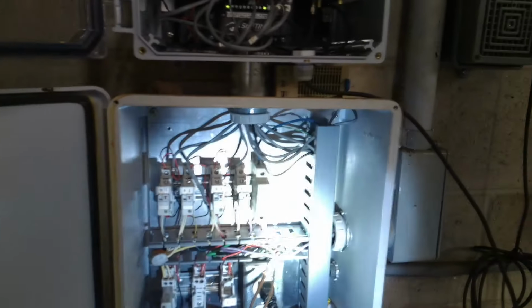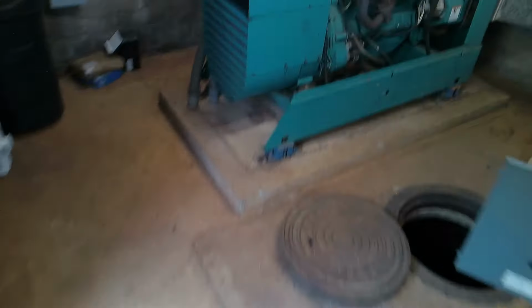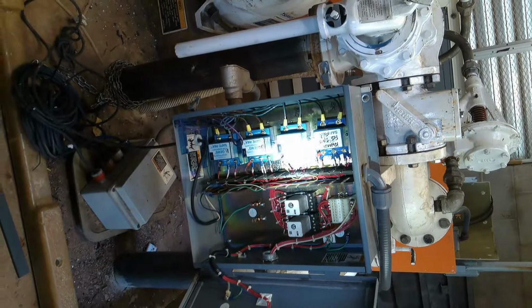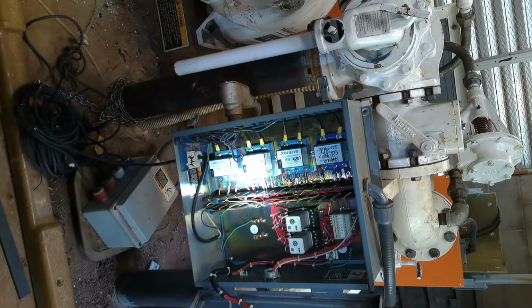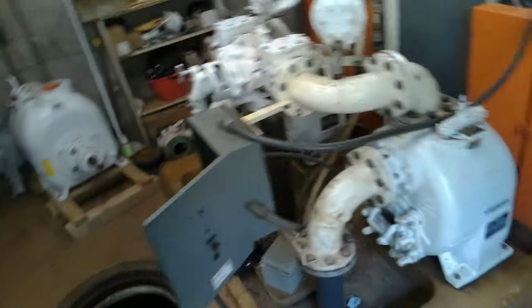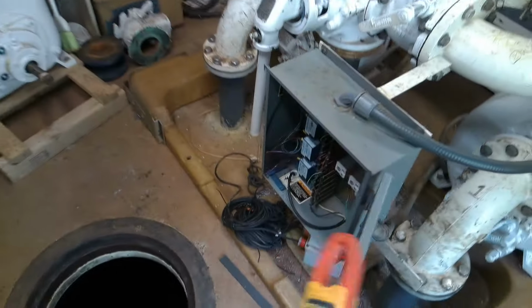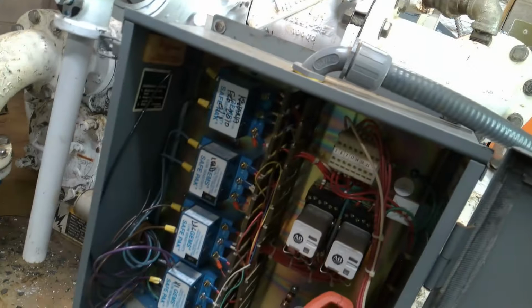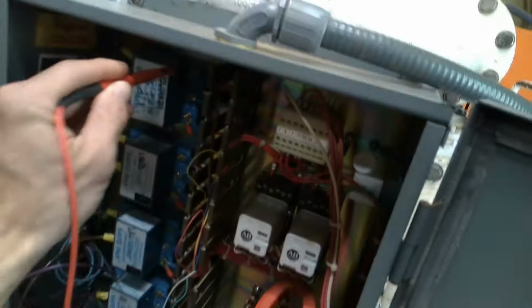And where is that supply voltage coming from? Is it coming from this fuse? Could be. And then if it is, yeah, AC constant load, yeah. Interesting. Okay, yeah, let's see what kind of voltages we're working with here. What's going on? Alright, so we'll just go to ground. That'll probably give us a good answer. Yeah, so we got 120 all the time.